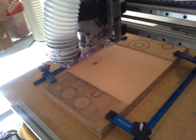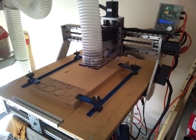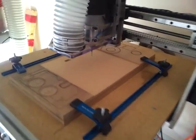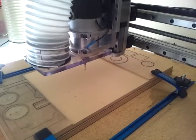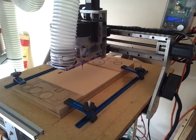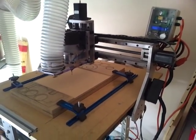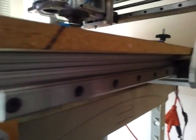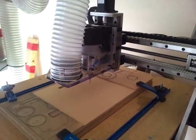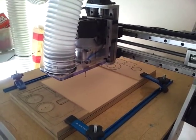That sheet in there now is about 16 inches wide by 28 or 30 inches long. This is the pocket here. It's a 20 millimeter ballscrew, 25 millimeter rail and carriages on all axes. So it's doing a test pocket at 110 now. I believe the largest circle is 5 inches for this one.